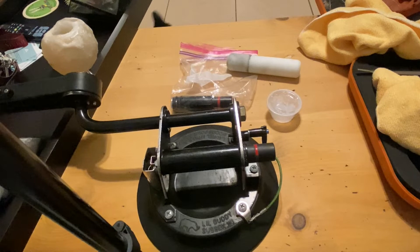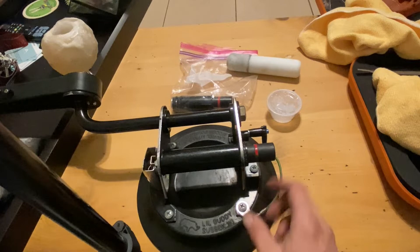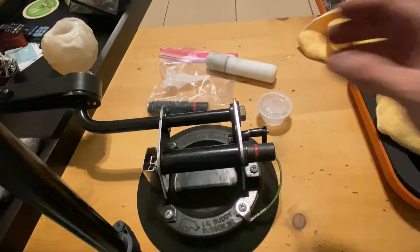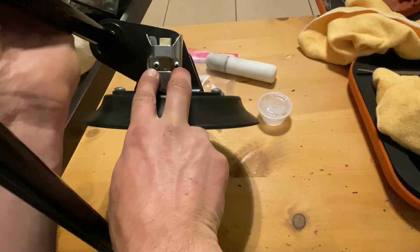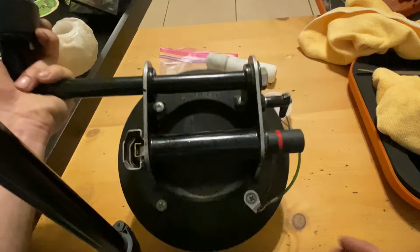Hey, what's going on YouTube, it's Mike with Sunrise Autoglass here with a video on some maintenance on the little buddy. After a while these plungers are going to have to be replaced — they just kind of lose their effectiveness. You can buy a replacement kit online. It comes with two replacement plungers, a little roller to clean out the inside, and some lube to help slide it through. This valve can also be replaced, along with those two screws if they get worn or stripped. I had an extra plunger sitting around so we'll do a quick maintenance, get it fresh and ready for the week.